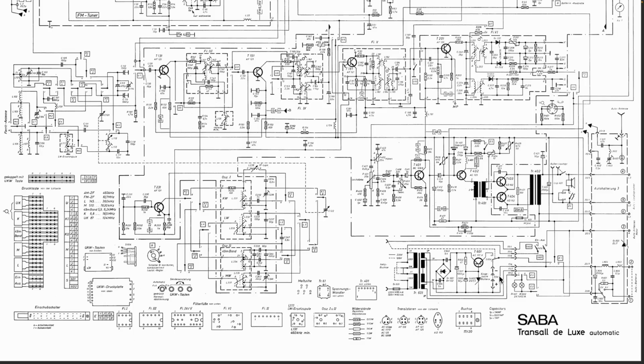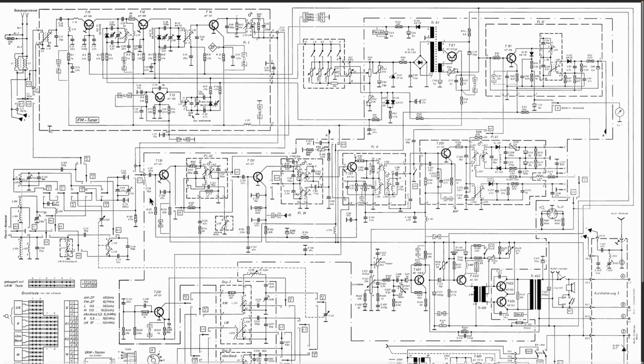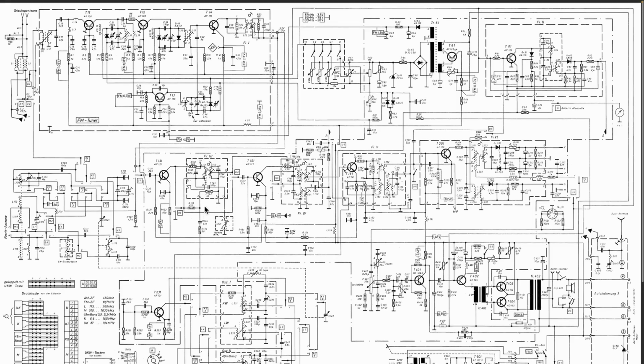In the old days, they wouldn't use a 50 volt capacitor when they needed 7.5 volts. And I'd probably do that now. I'd put 25, 35, sometimes even 50 volt capacitor. I'm trying to see here. There's one there. I'm trying to see what other electrolytics we've got here. There's another one there. Supposed to see 4.8 volts, but that's not connected to the supply. But there might be others that are actually straight onto the supply that have just got zapped with more than they were looking for. I know there's some electrolytics because I've seen them on the board, and there's actually one pretty big one, but I'm not sure where that is.